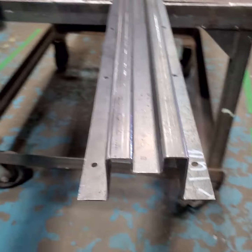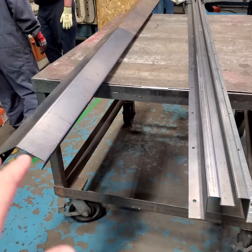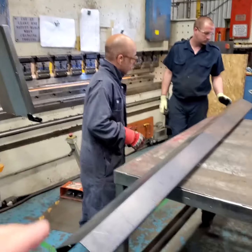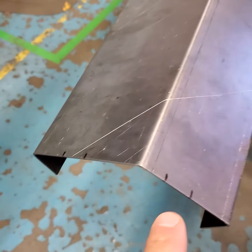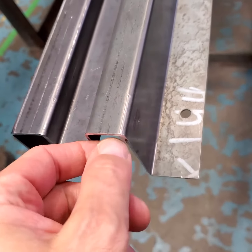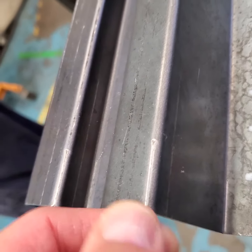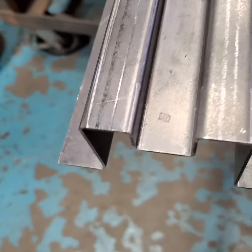Danny's not happy with the first one. I had two cut because I knew that he'd have problems. It's just that when you're holding it in the dies, they've got to have two operators to properly line up the lines. You can see there are lines on here — these are the plasma bend lines. And to actually line them up to be perfect, you can see here it's already off, out by a 32nd, and that just adds up.